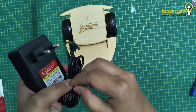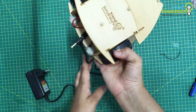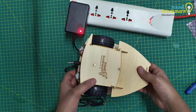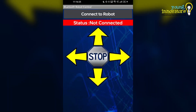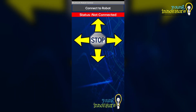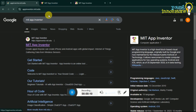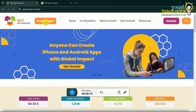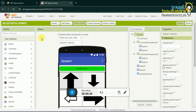Use glue to hold the face and motor holders in place, ensuring they are firmly attached. Test the robot with the 12V adapter by connecting it to the DC jack and powering up the robot — make sure all components are working. Install the Arduino Bluetooth control app from the video description, or use any other compatible Bluetooth controller app from the Play Store that allows you to send directional commands to the robot. If you want to build your own app, use MIT App Inventor — a web-based platform that allows you to create mobile applications for Android devices using a drag-and-drop interface, making it accessible even for beginners.